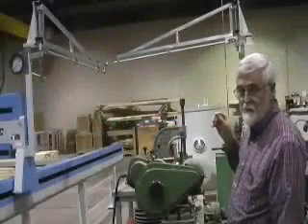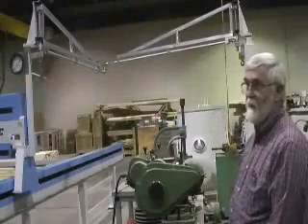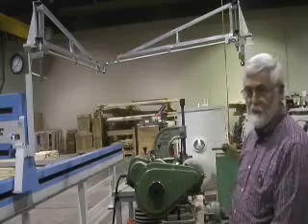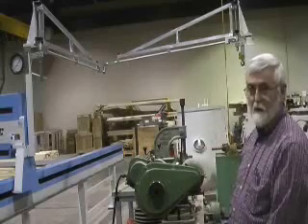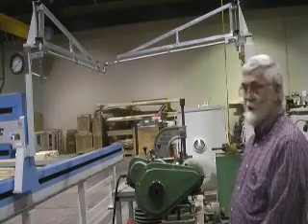To supply the water, we have a three swivel swing arm system, typically used when there is an overhead restriction so that you can't use longer whips, and also if you have a long bed, wide cutting X cutting system.